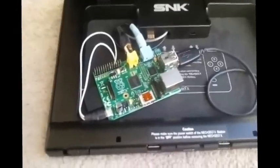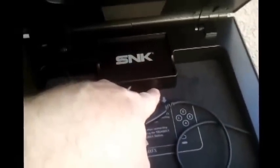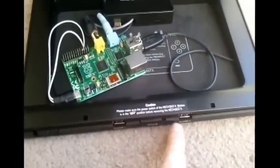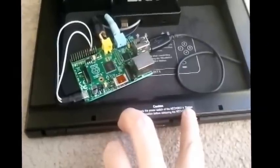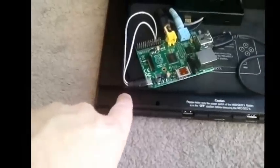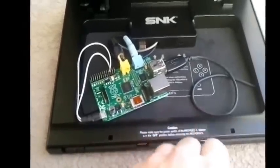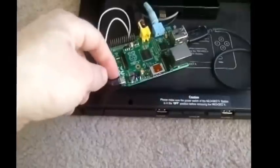I did some modifications to the base console in order for this to work. Basically what I had to do was disconnect the micro USB that was here, because the micro USB that pops out here runs along the side of the case to the front — to these two USB ports, which is essentially a two-port USB hub. The power and ground run from the back of the system, along the side, over to the switch. I disconnected the micro USB cable from the hub as well as the power from the hub, and ran the power to an old micro USB phone charger cable I had laying around.